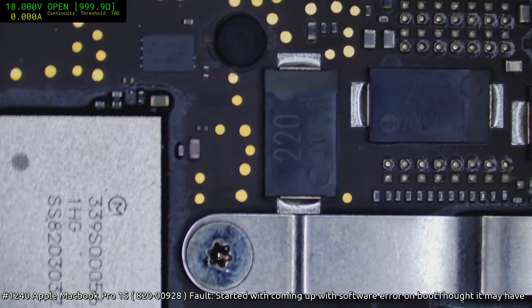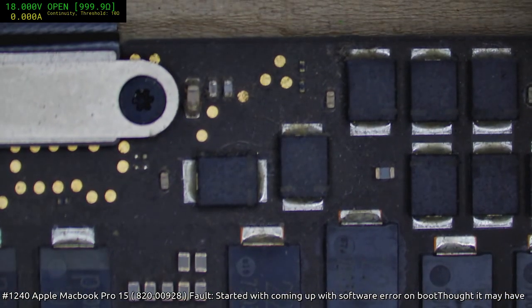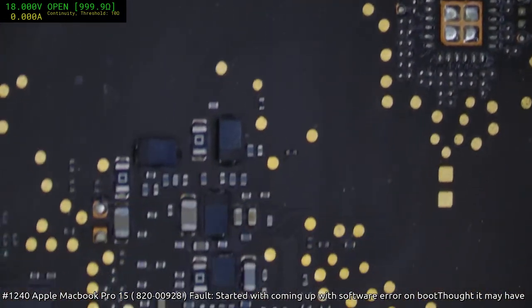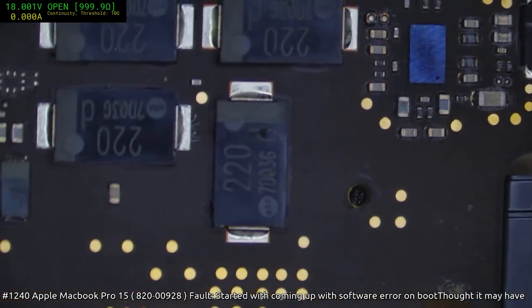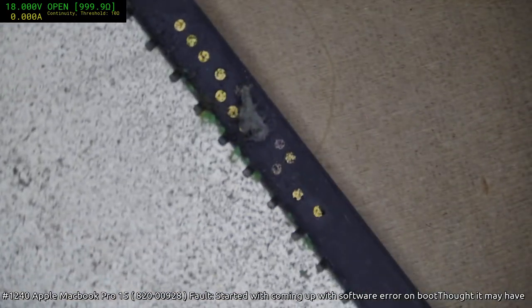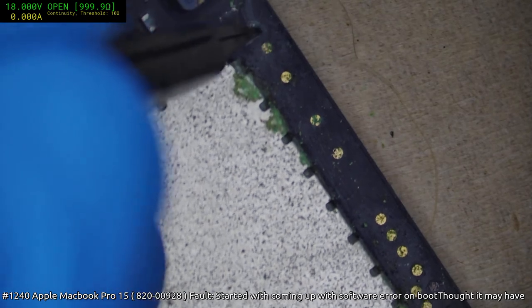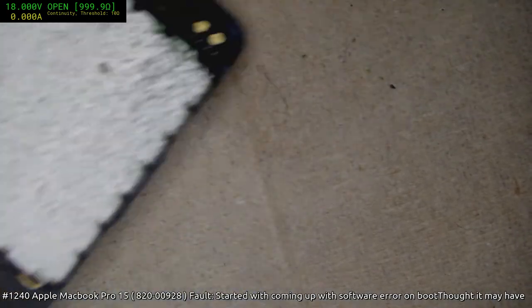Let's have a look at the rest of the board. Yeah, because you've got dust here, and there's no problems there. Funnily enough, the dust on the other side with the big shield, that was more your normal dust collects atmospheric moisture and then condenses into corrosion. So this here is more your atmospherical type stuff. There is actually a little bit of the slime on it though, I must admit. So I don't know. It's a new terrifying substance.